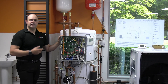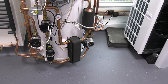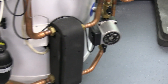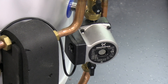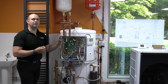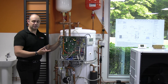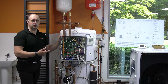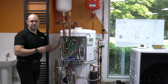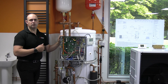SW3 number 7 is to do with whether the system has an external plate heat exchanger or not. If we've got an external plate, we've also got pump 4, forcing water in and out of the cylinder. However, if we're connecting onto a third-party cylinder with an internal coil, we haven't got pump 4, so we need to change that DIP switch to suit. It's activated if we have a plate heat exchanger, enabling power to pump 4, and switched off when we're working on a third-party cylinder relying on the coil.